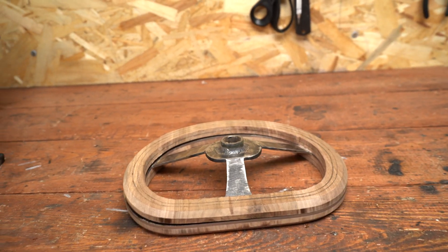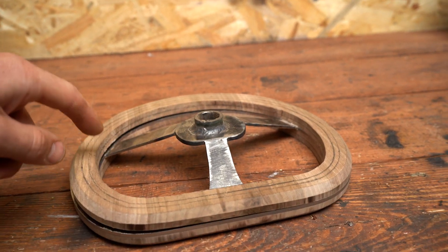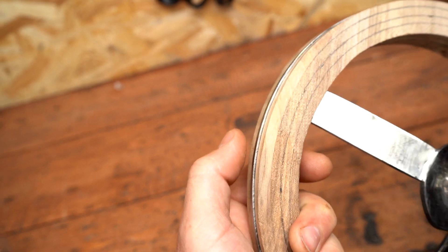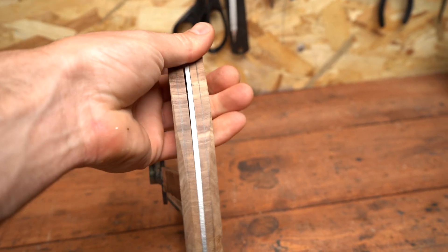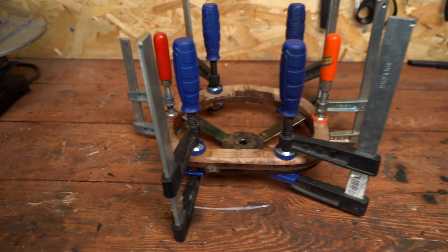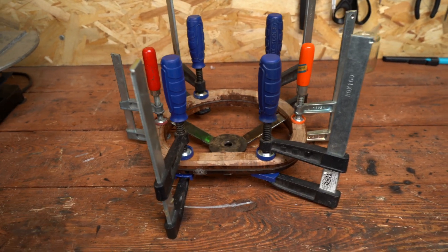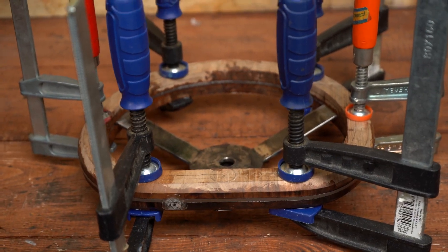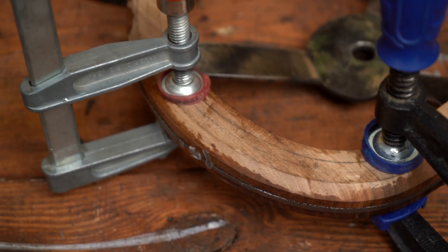I left it for a few days and found it had separated — looks like it hadn't dried enough, as you can see by this gap. I think there are three problems: first, the metal was too smooth and I need to use a bigger grit to sand it for better grip; second, the epoxy wasn't right; and third, the wood had moisture in it and it shrank.